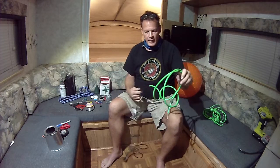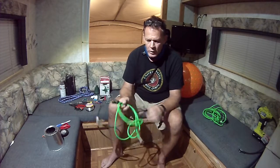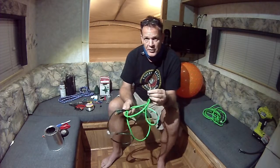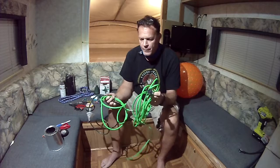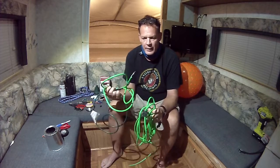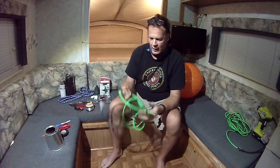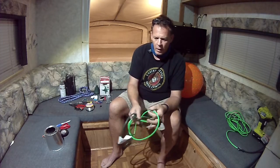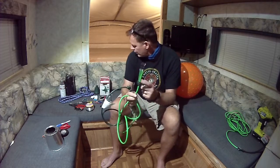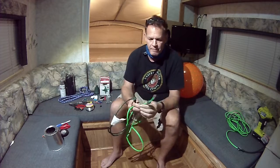But you're going to need some wiring. Now, one of the things with this wire is it only has 2 wires on the inside. There's no ground wire. So when you're getting an extension cord to splice in some wire for this, find yourself an extension cord that also has no ground wire. When you find that one, that's going to be a perfect extension cord for this application, so that you can get your 10 feet going all the way down. That's what it looks like right here. I've got the splice in there, ready to go. On this end, you can see I've got the connector that's going to go into the floodlight itself, and I've got the wires that are all ready to be twisted in for the application.